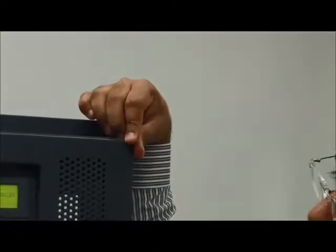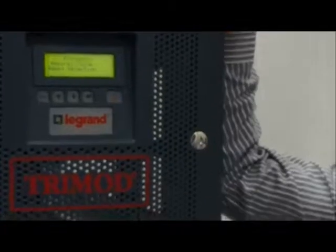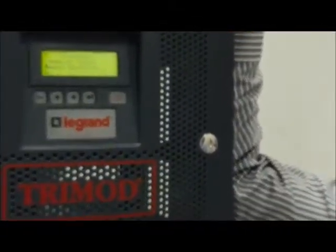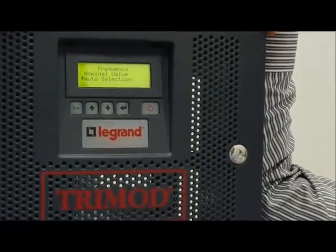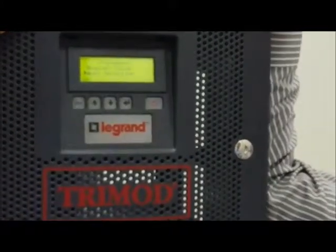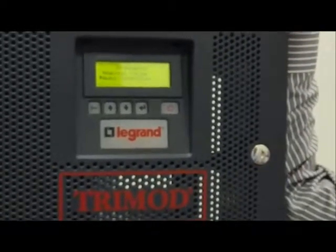We use enable, for example, in South America, like Brazil. If you go in the west of Brazil, they have 50 Hz. If you go in the other part, it changes from 50, in the same nation, in the same country, no. For this reason, they set enable in the UPS. If you're moving inside the country, it takes the correct frequency.